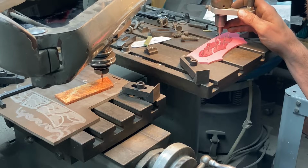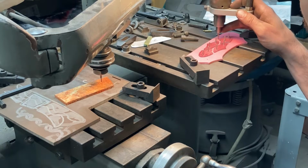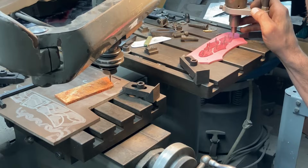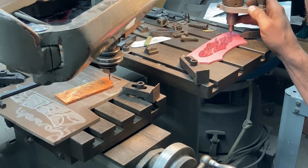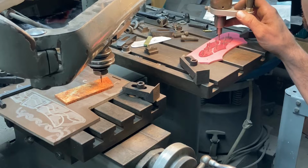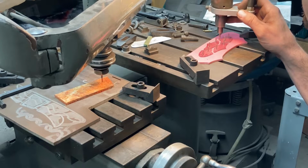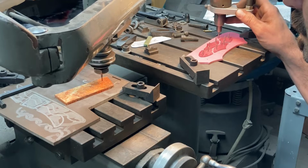And I have the stylus run down to where it's just hovering over the base plate by about 10 thou, so I get a true reading off of the maximum profile of these pieces. If there's any low spots near the edges due to inaccuracy in making it, I'm not going to be reading off of those. I'm going to be reading off the maximum profile of these.